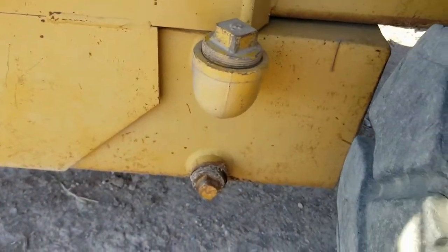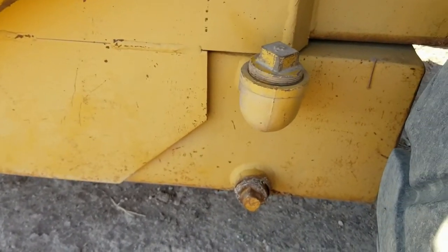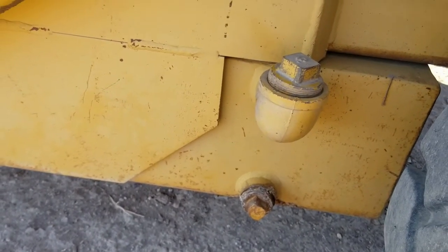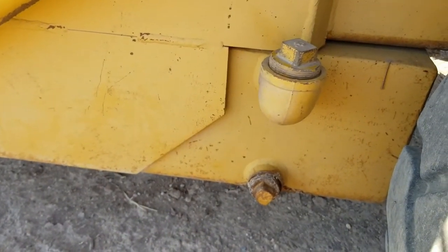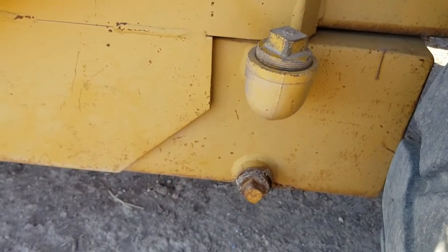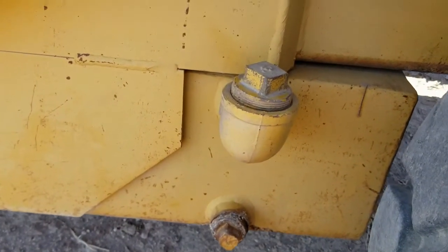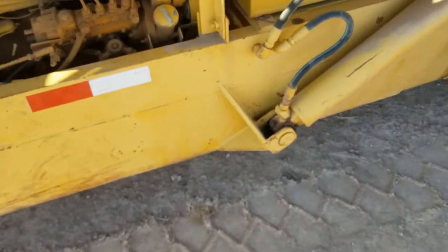And the fill, which is the top, and the drain ports for the water exhaust scrubber. You want to check that periodically throughout a shift. Ensure that it's running as close to full as is practical. That'll give you the best DPM reduction, cleanest air, and it'll be the most pleasant to run when that scrubber is full. It cuts about 30% of the DPM out of the machine's emissions. That's the textbook value, and I see no reason to really doubt that. This is a pretty large scrubber system.